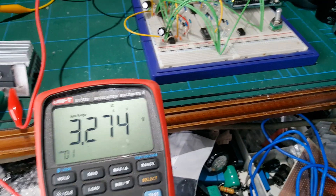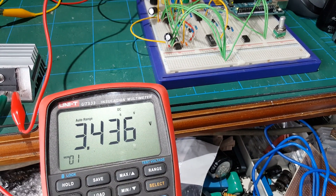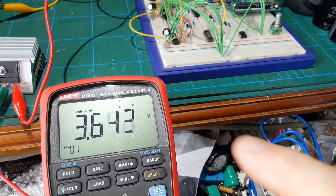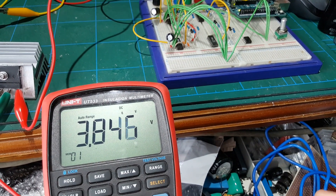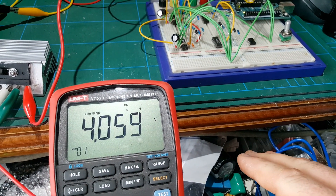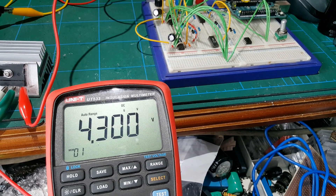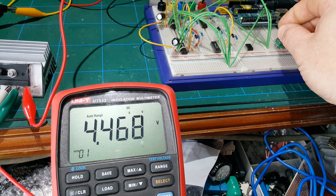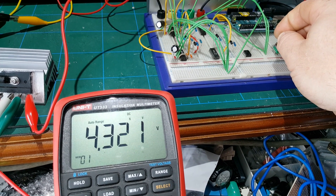Only slightly. Let's pretend we're driving down a hill — we've still got a good amount of braking there. But you can also see that the capacitor bank is charging rather rapidly. So if you've got an undersized capacitor bank, this is going to charge too quickly, and by the time you reach the bottom of a long hill, you're going to lose your braking effect, which is dangerous, and you're not going to capture all your energy.